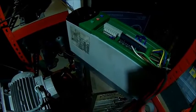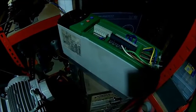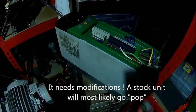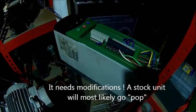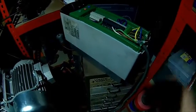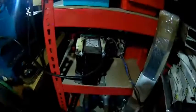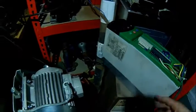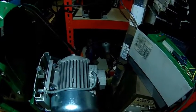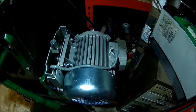Anyway, I'm running that from 440 volt single phase. It's a 400 volt rated inverter — actually 380 to 480 volts. I'm feeding 440 volt single phase, which I make with that transformer, and that gives me 3-phase output for the motor. I still need to mount that to the shaper somehow, but let's fire it up and see what it does.